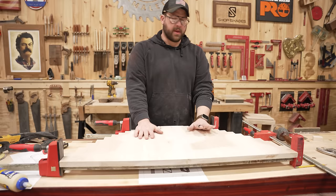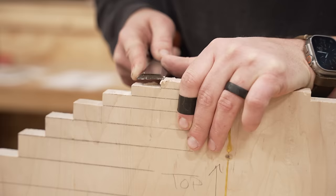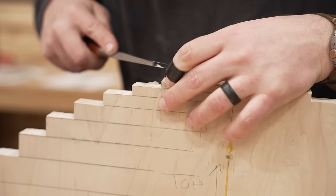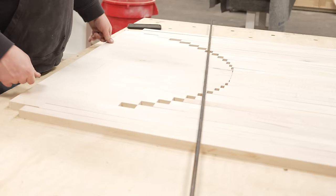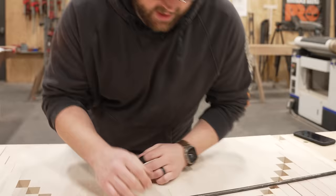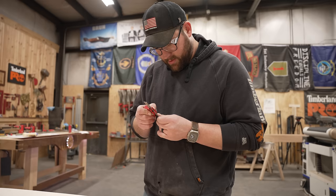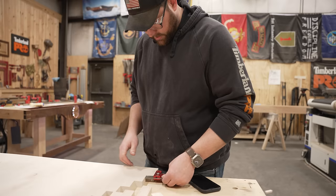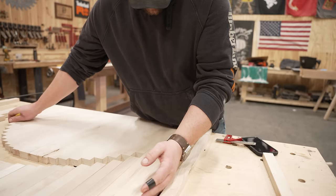So we're dry enough that I'm going to start messing with this. I do need to clean up this edge here because when I was in my cut, I was slightly off. Made a few marks on this side. Yeah, and I should just be easily able to get that to square. So this is basically the nature of it. What's crazy though is I did exactly what Chris wrote. I remember I mentioned I was concerned about the kerf. That's what this is. The kerf of that blade is kind of throwing me off. I think I might have to rip these down. It should be 1 5/16. Yep. No. Yep. Yep. So maybe it's just this guy. That's the problem though. It's the kerf. It goes back to the kerf.